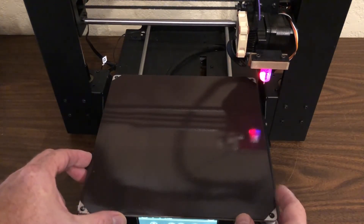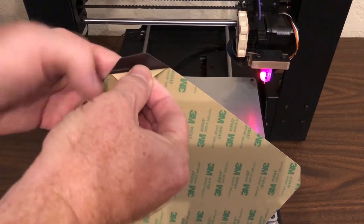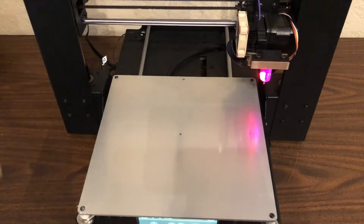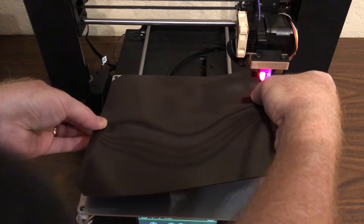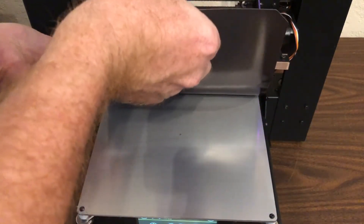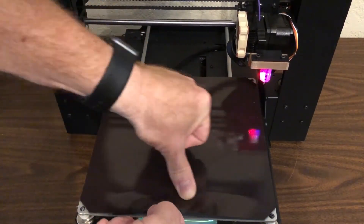Here's the Wham-Bam Systems magnetic base. This gets installed directly on the heated bed, and with those notched corners it is a perfect fit. Let's get the backing peeled off the magnetic base and then carefully install it on the heated bed. I peeled it off all at once, but a better strategy might be to expose about an inch of the adhesive and work your way forward. We'll start by getting the magnetic base aligned at the back of the heated bed. Accuracy is important — be aware that the adhesive is super sticky. Once you've got the back aligned and stuck in place, start pressing it down a bit at a time, working back and forth, moving toward the front of the heated bed. The point is to prevent air bubbles from being trapped under the magnetic base, so just go back and forth pressing down with your thumb until you have the whole thing stuck down.